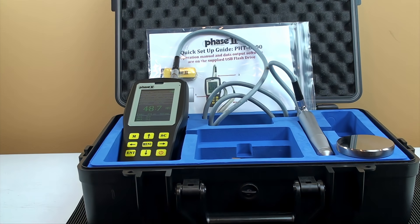The technology incorporated is based on ultrasonic contact impedance. UCI utilizes a 136 degree diamond at the end of a vibrating rod, being depressed into the test surface at a fixed load. At this point, the frequency of that vibration has changed. The difference in ultrasonic vibration frequency is then calculated into a hardness value.